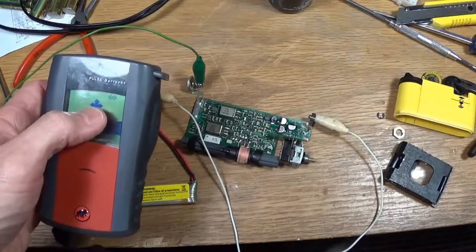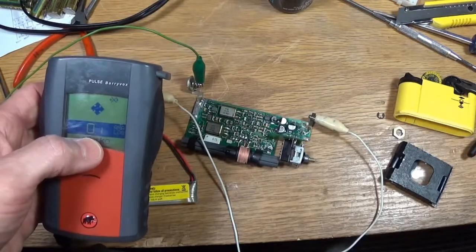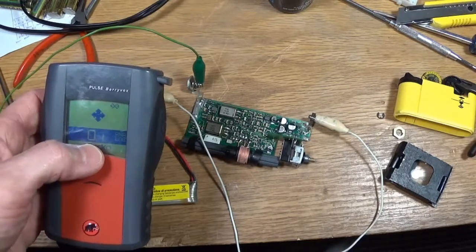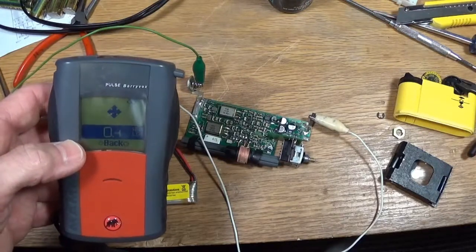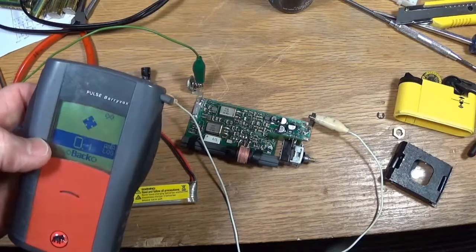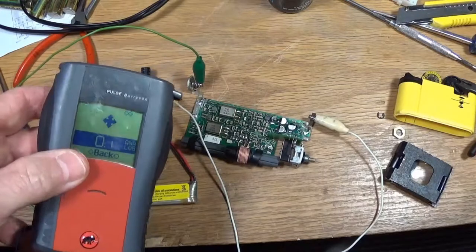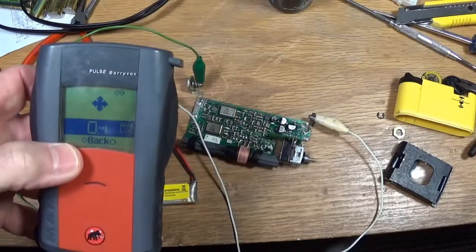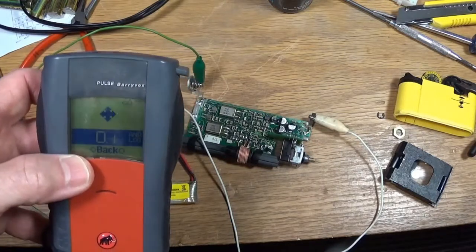And also this indicator across here, if you're far enough away, it'll actually give you a direction. The arrow will point in the direction that you should be moving to get closer to the beacon. So a whole bunch of signal processing is going on inside this modern digital beacon, so it can pick up a buried beacon. The transmit circuitry inside here would be very similar to that, except that the tone, or the 457 kilohertz frequency, is generated by the microcontroller.